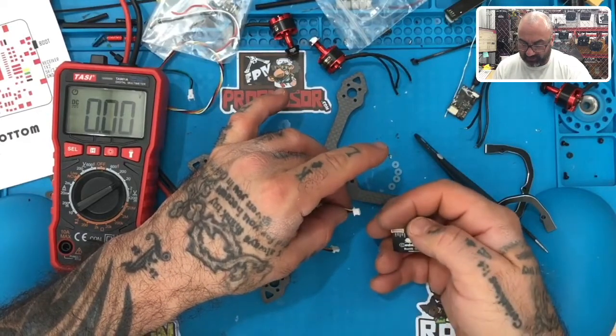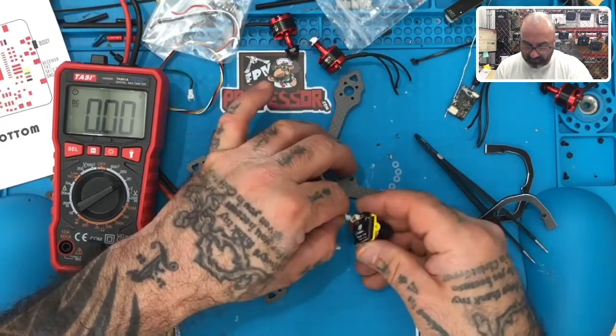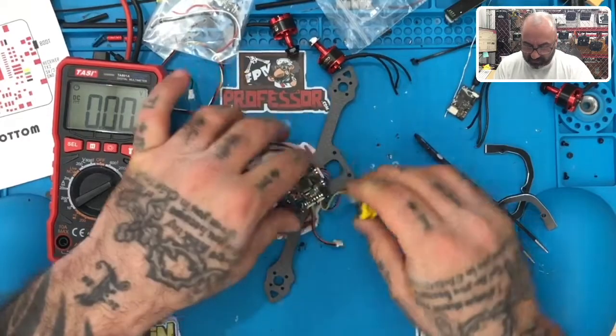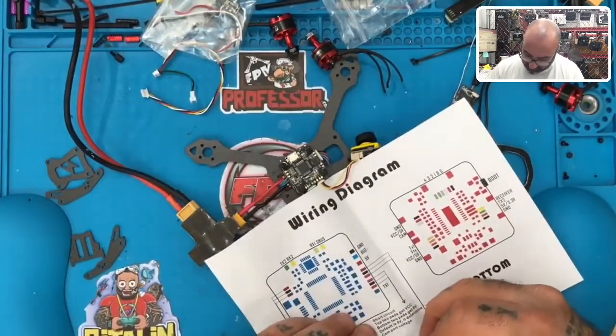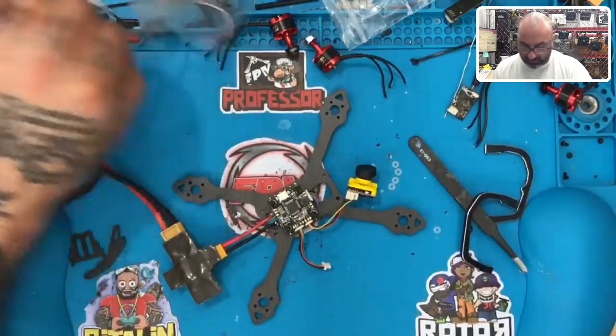So that would be very good. So let's make sure it lines up. 5 to 40 volts, ground and video. So there we go. So this should plug in here. Excellent. And that does, it is the right voltage. Okay, so we're going to make sure that we note here though, that if you're going to use this, another thing, and so cam equals VCC also. All right, now what do we have left?